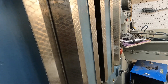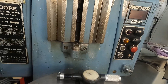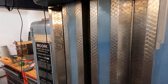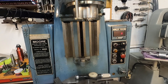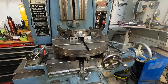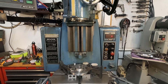Isn't that nice? I think I got some pretty good angles on that. There's still quite a bit of scraping on the table ways, but they have some wear — it's pretty even, and I just don't have any problems with this machine. One of the things I can tell you about is the vertical way here — you can see the condition it's in. The quill on this machine is in excellent condition — tight and just perfect.